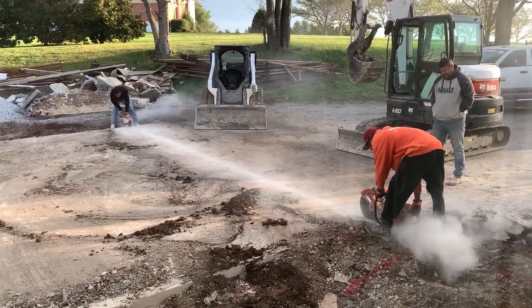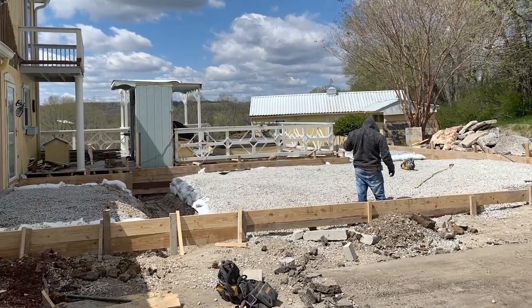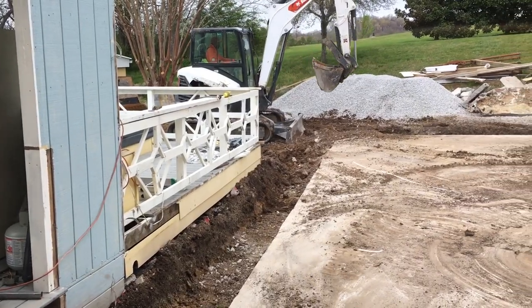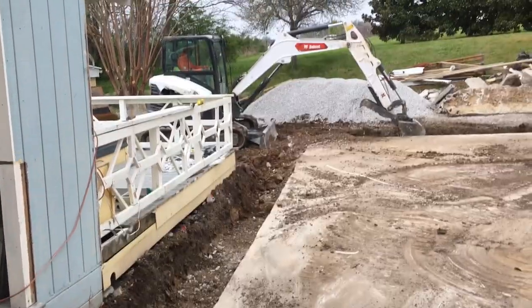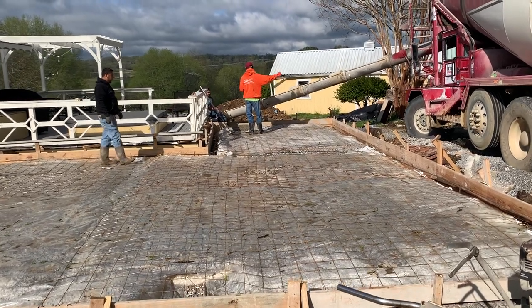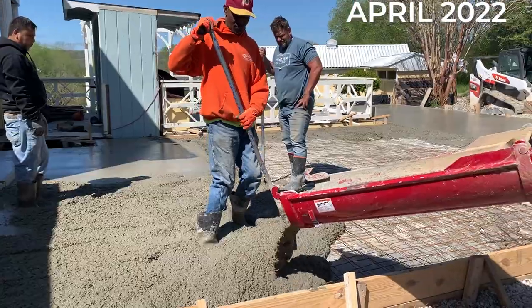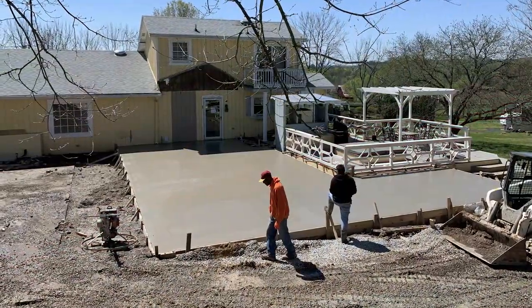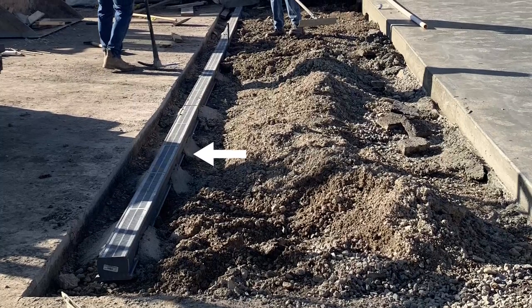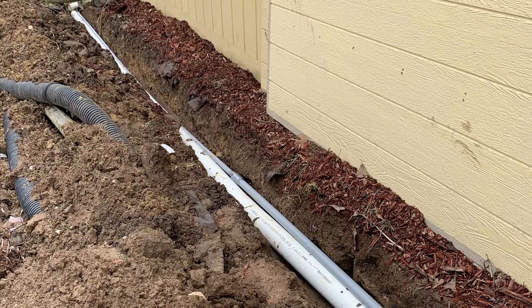Next, the concrete contractor cut the old slab and removed sections where the footings needed to be dug. It took several days to get the ground prepped and the concrete forms built. To get rid of the slope and level the slab, we had to set the new height 18 inches above the old carport slab, which coincidentally lined up with the deck and house main floor. After what seemed like 100 delays dealing with inspections, the concrete was finally poured mid-April 2022. A ramp would transition to the level of the blacktop, and a drainage trench was to be installed across the entire slab to direct any runoff into the front yard, well away from the house.